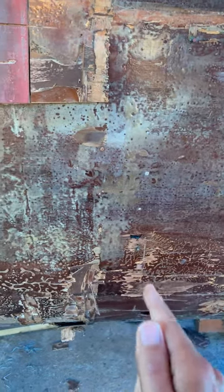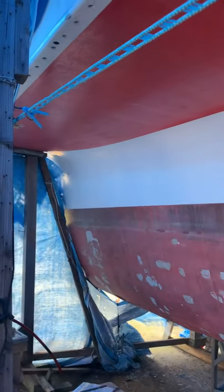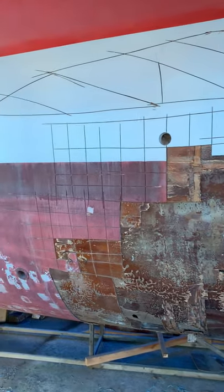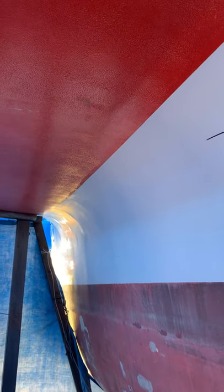Watertight deck, watertight deck, watertight deck. And this is a rare glimpse into what happens when the decks get neglected and moisture makes its way in. These boats are full of crevices, most are, and it's not the material that fails the mariner. It's the construction practice and negligence, gross negligence. Rainwater is poison for anything that's made out of wood, and just because something is sheathed in glass and covered in epoxy does not mean that a nick or crack or unsealed hole up on the deck will not cause problems like this.